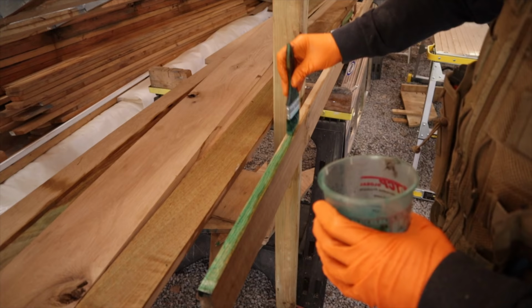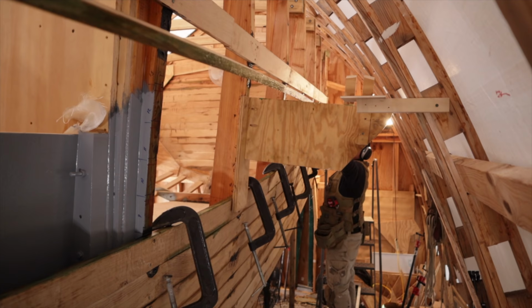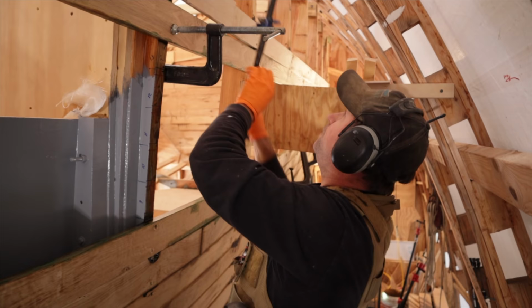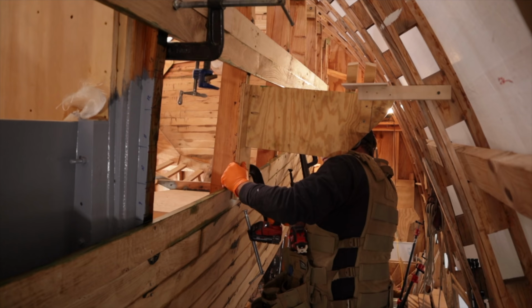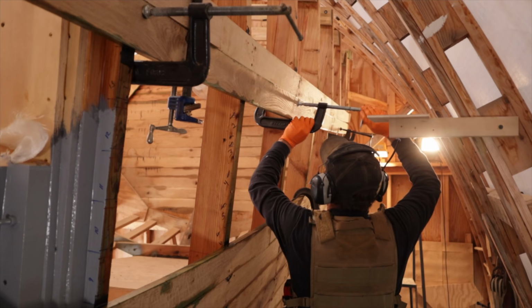once I got to the aft end, I began working from the shear line down just like I did in the previous video. There were no surprises here, a few tapering cuts to make sure things fit nicely, and then I repeated the successful technique that I used on the starboard side by laying a very wide board that I had been saving for many years in my private stock, secured it to the side of the boat with a few screws, then I went inside the boat to trace the pattern to get an accurate cut. This technique allowed me to essentially create a custom stealer that would even out the number of boards going forward so everything looks symmetrical in the forward section.